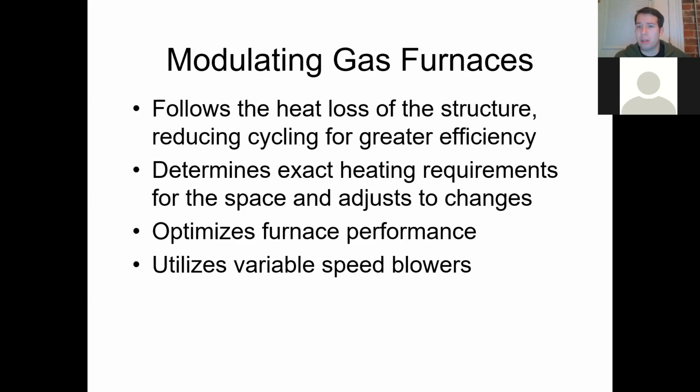Again, these are going to be basically for gas pressures. Instead of a 2-stage, you're looking at a low stage and high stage for your gas pressure and seeing, okay, what is the gas pressure at the low side? What's the gas pressure on the high side? These gas furnaces will have it set as a minimum and a maximum gas pressure. Typically, it's going to be controlled by a set of dip switches on the board when you get to the testing component of this and start actually adjusting the settings for that gas pressure.